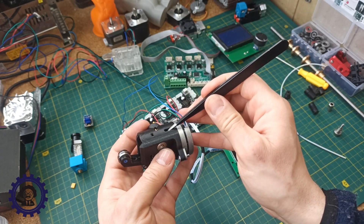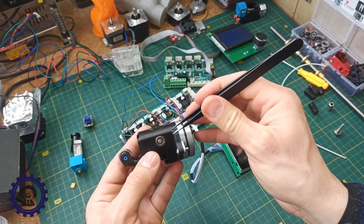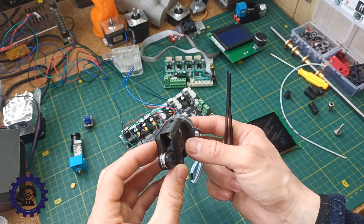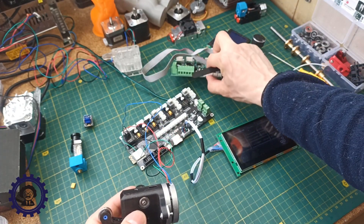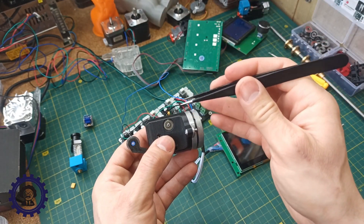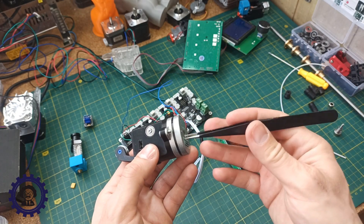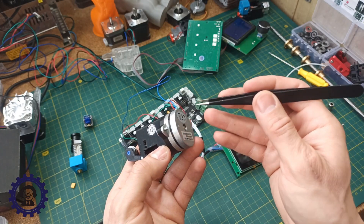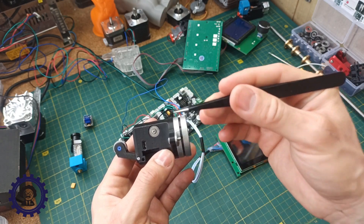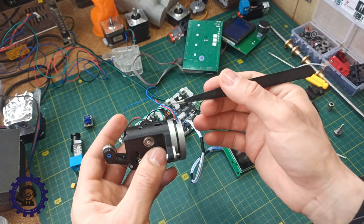The first problem is the gear ratio. Because of the huge gear ratio, there were problems with the engine. On our motherboard we have 1/16 microstepping. If we reduce it to 1/2 or 1/4, the situation will improve. But guys, I will tell you that this does not actually solve the core issue — changing microstepping is just changing microstepping. It does not save us from the huge power demand on the engine, as even Stepper Online confirms.